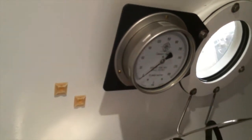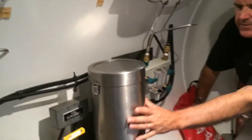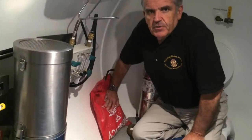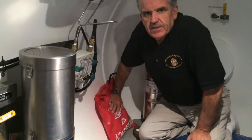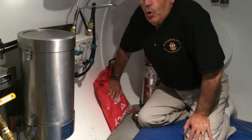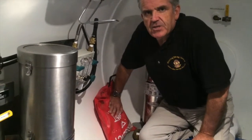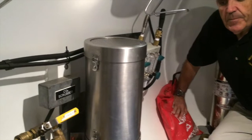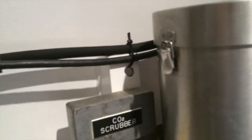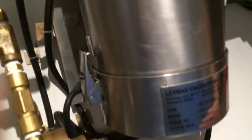This chamber is uniquely fitted with a carbon dioxide scrubber, and it's rare that we will use this except when we do treatment runs or use the chamber for long periods of time. We can actually run this chamber on closed circuit. All we would have to do is turn on the switch on the outside for the CO2 scrubber. This is filled with sodasorb, which is a carbon dioxide absorbent. There's actually a fan when we turn it on, and it's going to take air from inside the chamber and force it up through this canister and remove carbon dioxide from it. It actually helps maintain the atmosphere quite well.